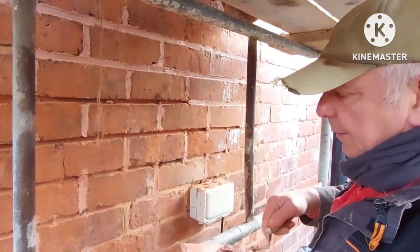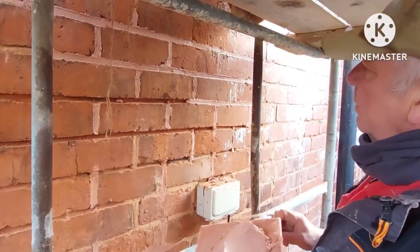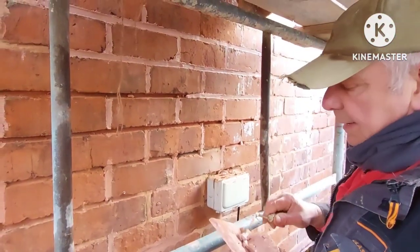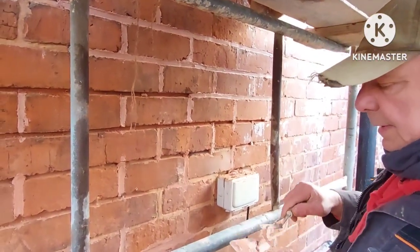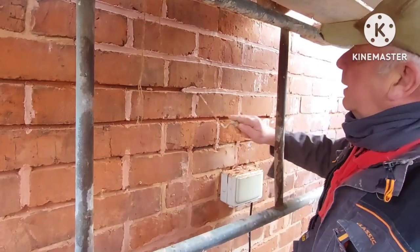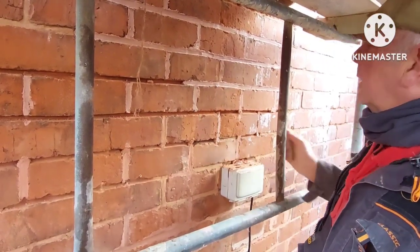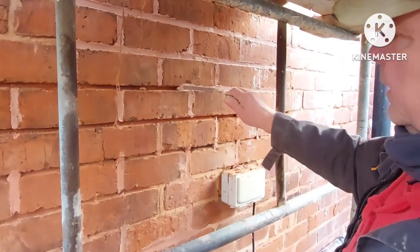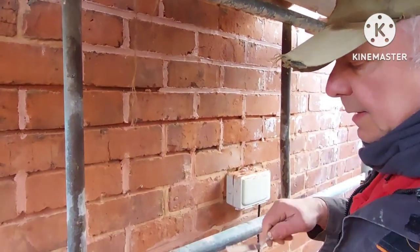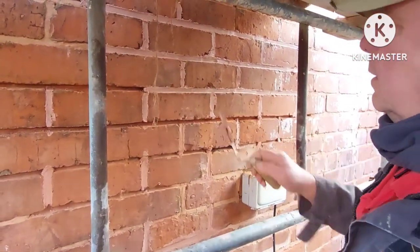When you're pointing on brick, you need to know roughly what material was used initially — was it a fine sand, a gritty sand, where was the sand from? Now locally to us on the Fylde coast in Lancashire, these houses were predominantly built with local sand — beach sand — and quicklime. So today we're using a fineish sand with quicklime, at a ratio of four to one: one of quicklime and four of fine sand. When I say fine sand, it's not that fine — it has got a bit of grit to it, but it's finer than a heavy grit sand you'd use on other projects.